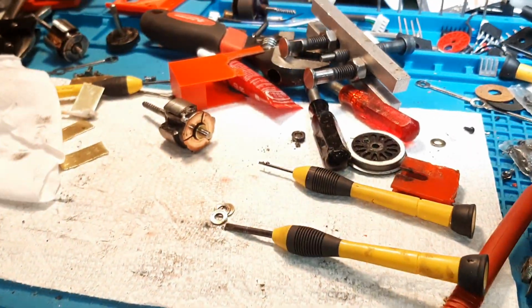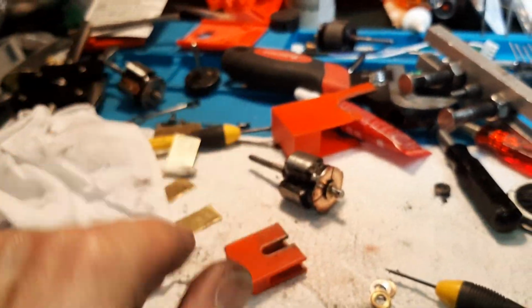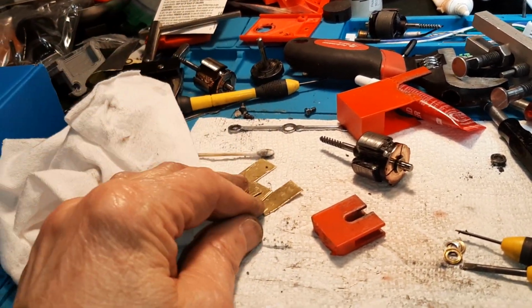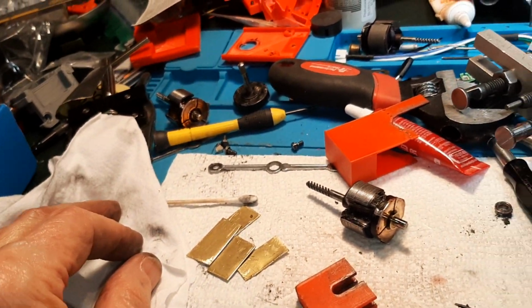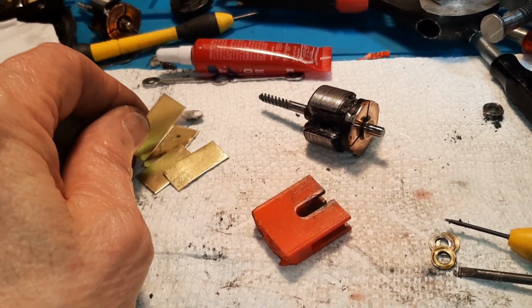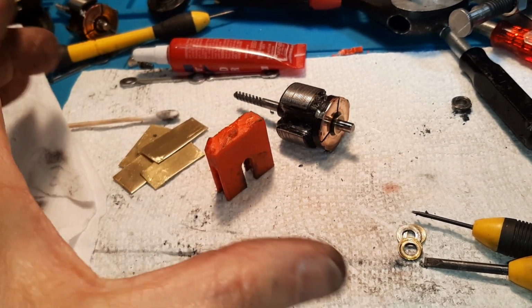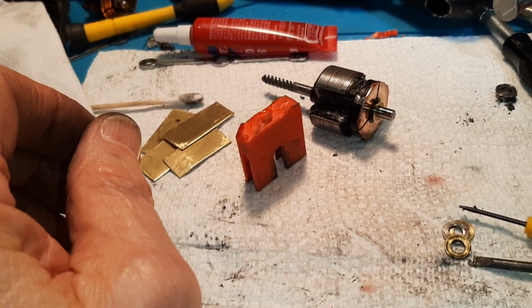So that's the plan. I used my spacer doodad, and boy, did it help center that gear up. I use these shims here. I don't have a fixture for them yet. I tried to do those in plastic, but the plastic is just too thin at that point and they just break. So I had to go to this for the outside of the wheels. That's the size of a dime. Put one down each side, put this on either side of the gear, and you can squeeze them together, leave them a little loose so you got some movement.